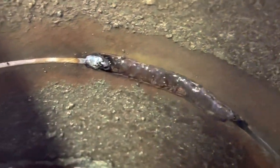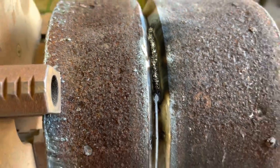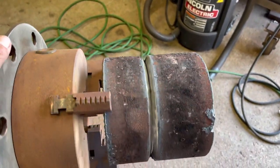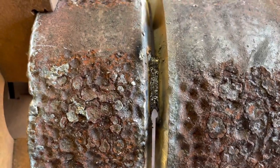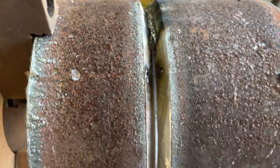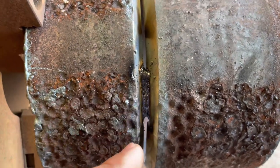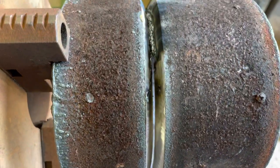That's more like it right there. A good tip: I'm standing right in front of my rollout, so I'm going to roll this way. You want the keyholes to be at the bottom part, opposite to where you're rolling from. That way when you're tying in, you're not tying into a keyhole. What I mean is, if I was putting this root in and getting close to the other tack, I'm going to tie into the tack, not the keyhole. It gives you an overall better weld — not saying you can't do it, it just looks better.